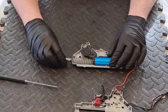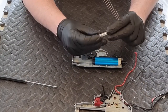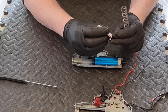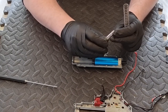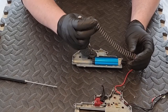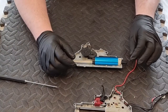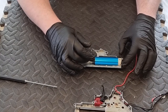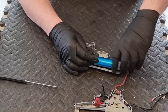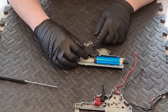Let's remove the main spring. It's a strong spring - we haven't got a bearing spring guide but we have got a metal spring guide. Have a quick look at the tabs - they look okay, no marks there. No lubrication on that guide, which we might add. The spring is in good condition - you want to check for cracks, make sure it's not split anywhere. That spring looks all right. Next we'll take the nozzle, tappet plate and cylinder assembly out and check those.